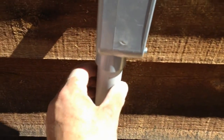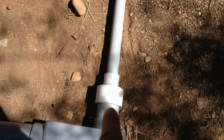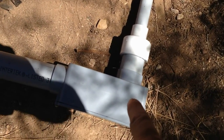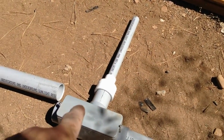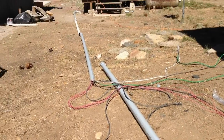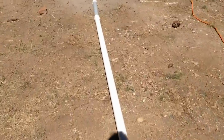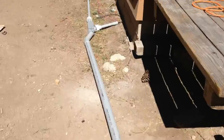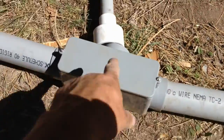I could not fit the three six-gauge AC wires in this as well, so that's going to come out here through a one-inch conduit, come down, and go through the reducer — or enlarger, however you want to say it — into the two-inch conduit. The trimetric and the DC wire that I'm pre-wiring will come through and run underground through this two-inch conduit all the way down the main highway.